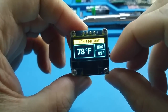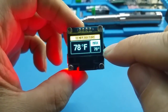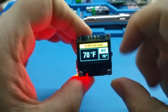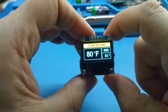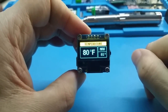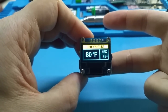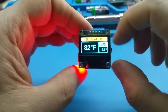With this button you can change the temperature setpoint. I had it at 78 degrees Fahrenheit maximum, and now I'm adjusting it to 81. As soon as it hits 81 — let me try to simulate that with my finger. Wait — yes, I do radiate heat, so the alarm triggers.